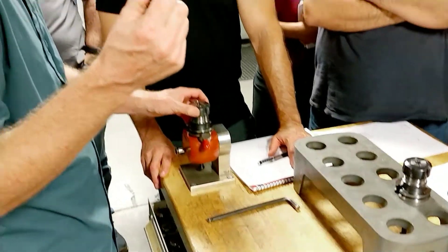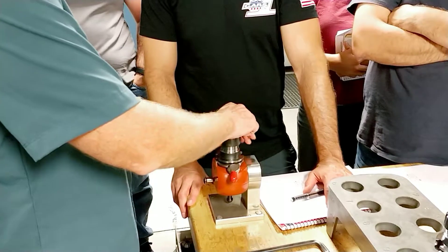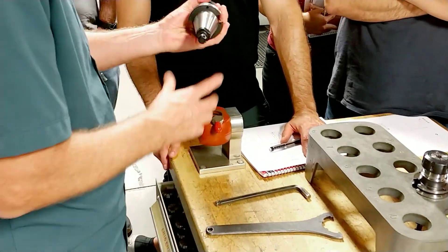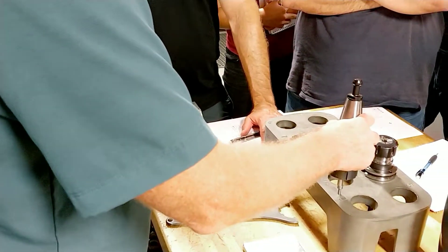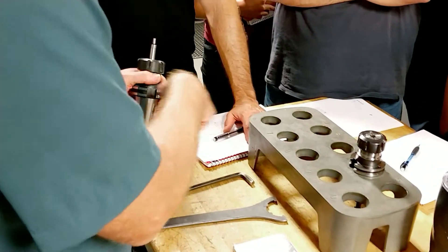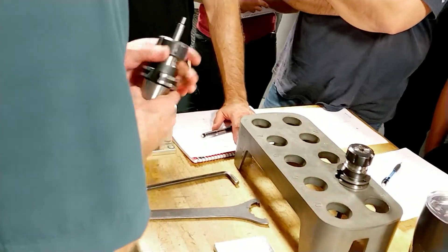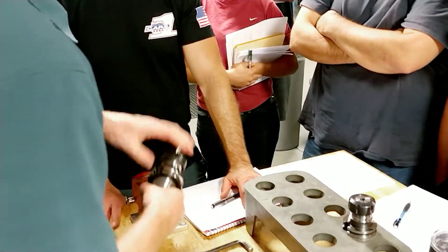Normally you use a wrench to tighten these collets, if you're going to be running a drill or an end mill. But for indicating, just tightening by hand is perfectly fine — that's good enough. The nice thing about doing it by hand is if you make a mistake and you jog Z instead of X and Y, more than likely it's just going to slide the tool up inside the collet a little bit. If you had it tightened, it might be a blunt force and instead of just pushing up it could overload the Z-axis amplifier and blow it out — which is about a two-thousand-dollar mistake.